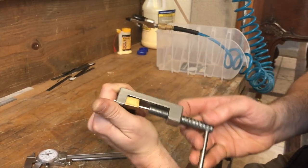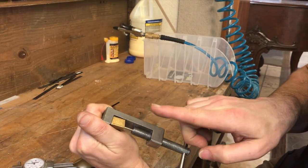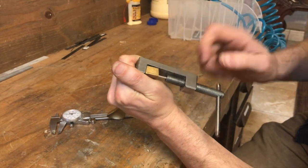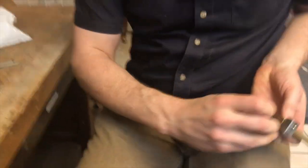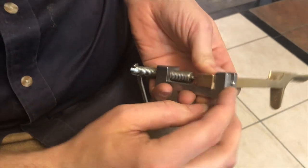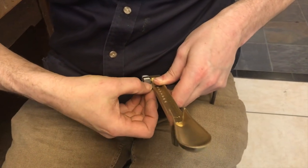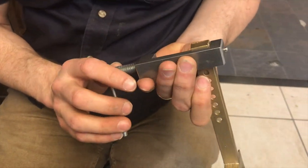If I were to push that in, that's just going to bend it, because there's some force going kind of that direction because of that angle. So maybe I'll try putting a little shim in there, trying to fill in that gap. Maybe I'll do another one on the other side. Just from experience, I guarantee if we don't put a shim in there, that pin will bend.